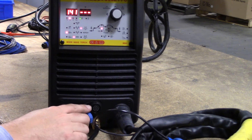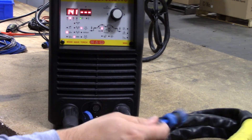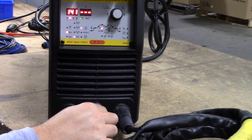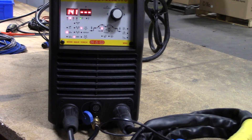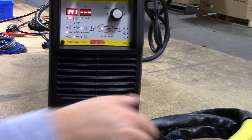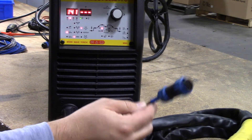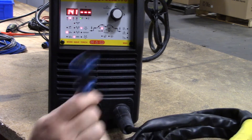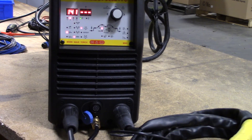This 12-pin port is going to be occupied by one of two things. If you want the heat to be controlled by the TIG torch itself, you'll plug the 12-pin from the TIG torch into the receptacle. If you'd like the foot pedal — which does come included — to control the heat, you'll plug the foot pedal connection in its place. So if you plug in from the torch, the torch controls the heat. Unplug it and plug the foot pedal in, and the foot pedal controls the heat.